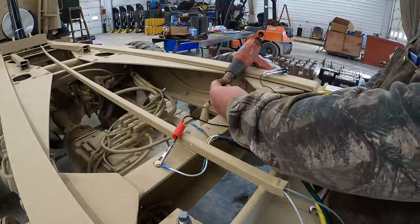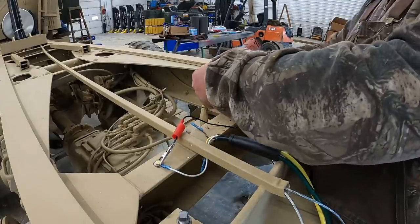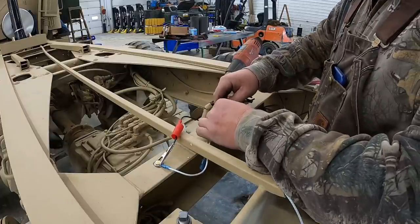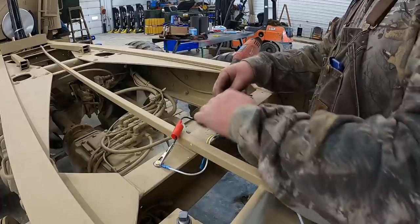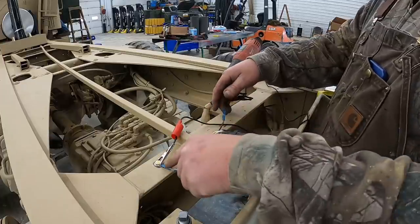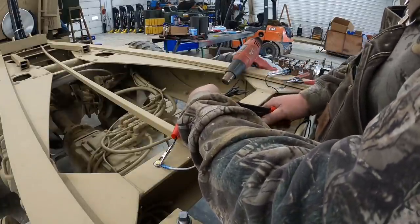We're going to strip it. It's actually our run light, so that's going to go to the brown wire. It's kind of a universal color on anything as far as your running light. So we're going to hook it up here. And then we will repeat with the left and right hand turn signals and find those, because we just need the three wires for the bed. I already got the ground hooked up. So I'm going to go ahead and get this crimped, and then we will find the lefts and rights.